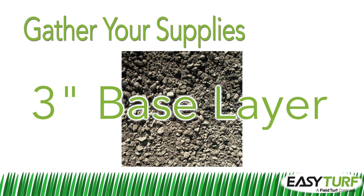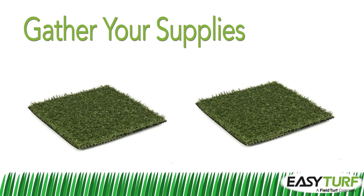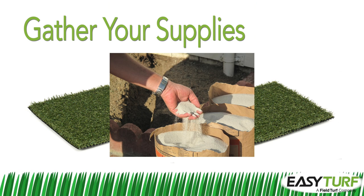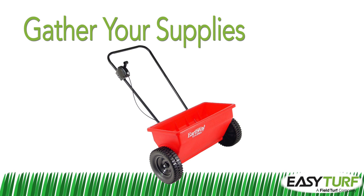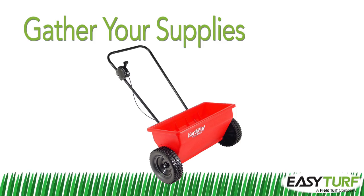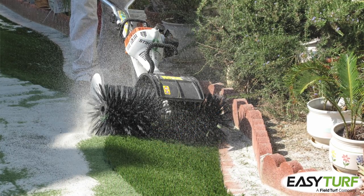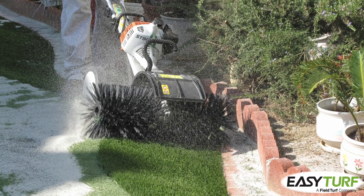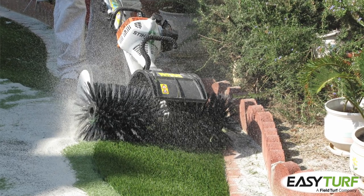You will need to add more if you have plans for a deeper base layer. And of course you will need enough artificial turf to cover the area and the recommended quantity of infill materials for the turf. A lawn drop spreader can help spread the infill material evenly over the turf, and you will need a stiff bristled broom or power broom to brush the infill into the artificial grass. Always broom the infill into the turf against the grain of the turf blades — this will allow the blades to stand tall, supported by the infill material.